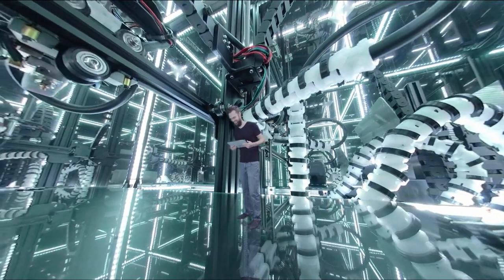I can't print this bigger with a bigger tire, because my printer isn't bigger. Well, it is a 500 by 500 millimeter build plate, but I reduced it to 420 millimeters due to the tubing chain. I had to shave off a few millimeters of this rim in order to make it printable on that printer. This is fully maxed out with the stuff that I have here. So let's see if it fits.